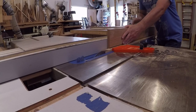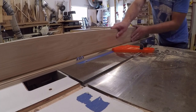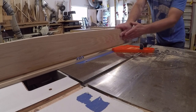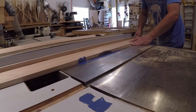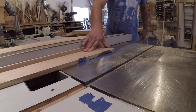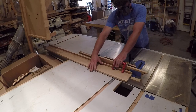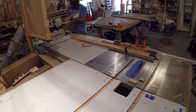When I originally cut the stock for the miters I left it a little long, just in case one of them got out of square or I screwed up the miters somehow. Now that the component is assembled, I ripped the stile to its final width as well as the sides of the mantle. I also left them a little long so when I glued up the miters I could slide the parts back and forth to try to match the grain. Now that it's assembled, I squared one end on each piece and then set up a stop block to ensure they would all end up the same length.